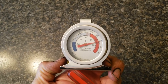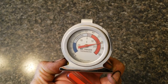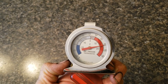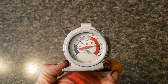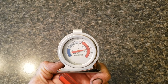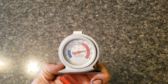I've already done mine — we were at about 80 degrees in the house, and that's another way to gauge where you're at. I know the house is set to about 64 degrees, so 80 was incorrect. After adjusting, it's sitting just above 60 degrees, so I feel pretty good about that. I'm going to put this in the fridge and come back to check it in about half an hour — we should be right at about 38 degrees rather than the 50 degrees we had before.